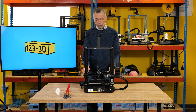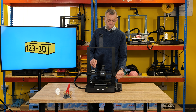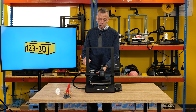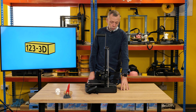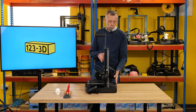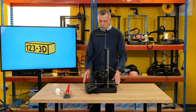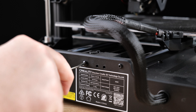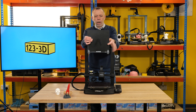The only things you may need to do out of the box is tension your axis belt — this axis travels on a belt tensioned by a socket head screw on this end of the machine, very simple to do. All printers require manual tension into the belts as they wear and stretch. The bed is driven by a quite clever design — on older machines, the stepper motor was mounted on the rear. They've now mounted it inside the actual casing so the belt travels all concealed within the base. It's very neat and tidy, and you can quite easily tension it by tweaking the socket head bolt on the back of the machine.